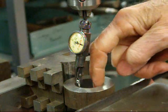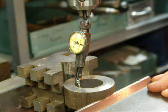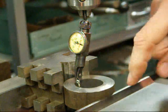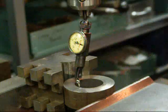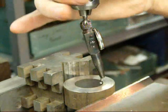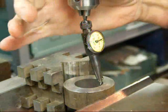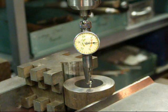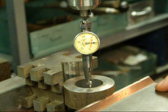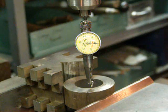So now we've got a zero reading. Now make sure there's no burrs in here — if you've got any burrs or rough spots that's going to give you a little fluctuating reading. Now if it's a rough piece of stock to start with, you're just going to have to deal with that. But this was fairly smooth inside because it's been machined before, and I knew it to be truly round. If it's out of round you're going to get funny readings that might be hard to figure out. Check it one more time and then lock your table — both your x and your y-axis. We are now on true center. The center of the spindle coincides with the center of the hole. It was not necessary to use a digital readout for this operation because all of our readings are taken on the dial of the little Starrett last word indicator.